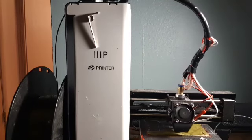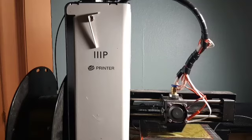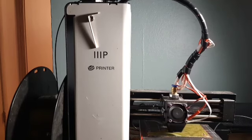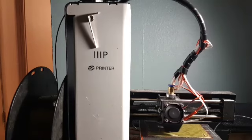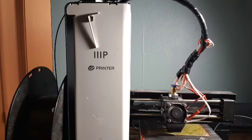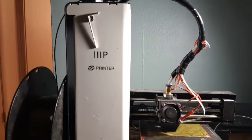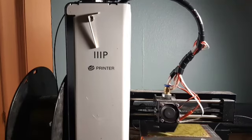I have done my own Frankenstein rewiring on it. I had to install a new heating block because I broke the neck between the heat sink and the heating block. You must be very careful when replacing the extruder heads on this model, because if you're not careful it is very easy to break the threaded end for the connection between the heat sink and the heater block. I ended up just ordering a whole new assembly rather than dealing with sourcing individual parts.